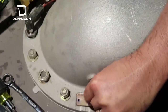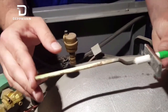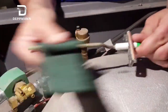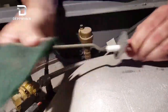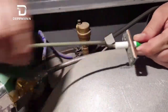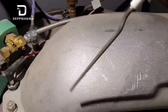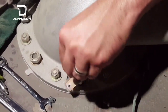The gasket will stick down; just gently work it free if it's been in for a while. When you pull it out you'll see white material on there — that's all the buildup from corrosion from being in the flame. I generally just use a piece of 3M Brillo pad to polish it. You want to clean the surface without taking off the top layer of metal — just polish it. Don't use anything too abrasive. Once it's clean and you just see metal, also inspect the porcelain to make sure nothing is cracked. This one will need a new gasket. To put it back together it's the reverse operation — it only goes in one way as the holes will not line up if reversed.